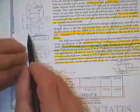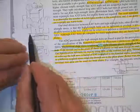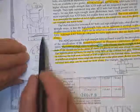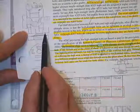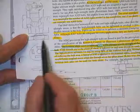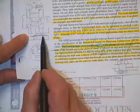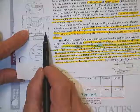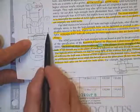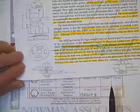And what they do is, here's the head of the nut, or head of the, yeah, it's the nut. I think they use that end. Here's the nut. Right now, a feeler gauge goes in there, no problem. But when you crank this nut down just the right amount to push this little thing back in the hole from whence it came, you can just barely get a gauge of a certain size in there, and that means you have pulled that head of that nut down and caused the right pressure between the head of the nut and the connected surfaces.